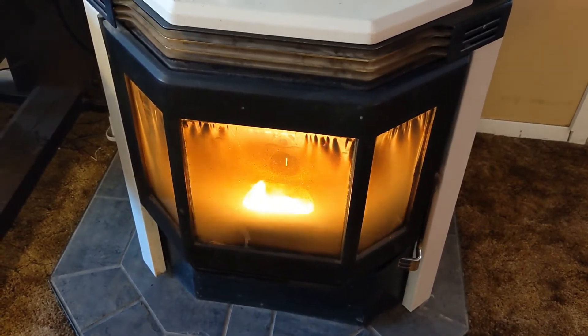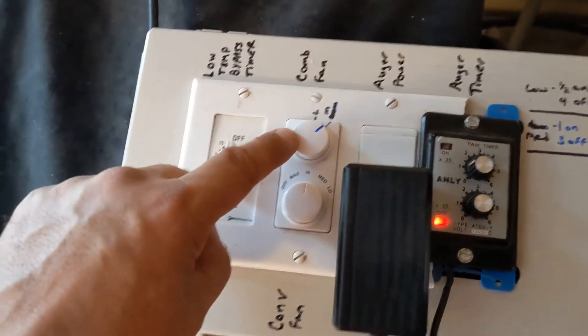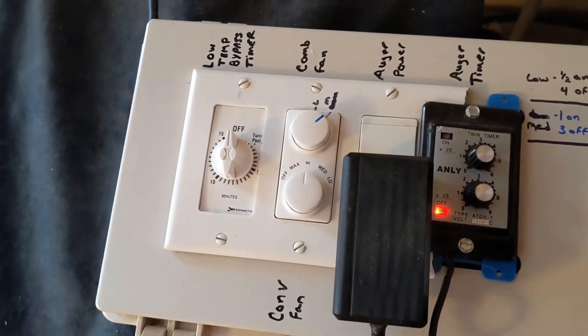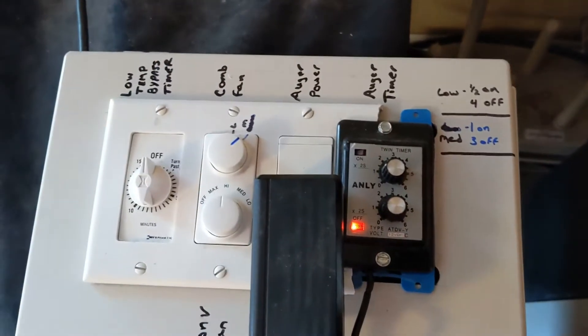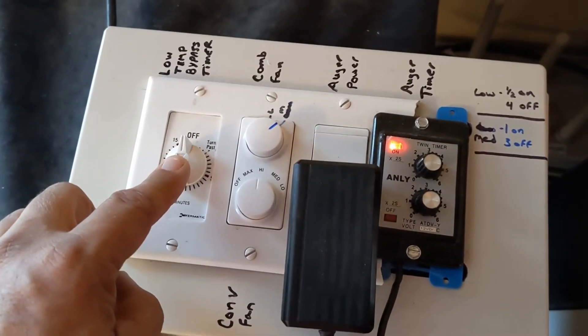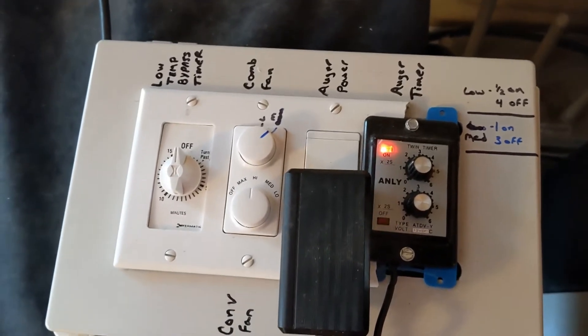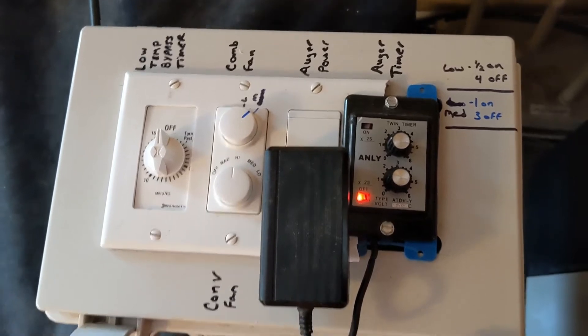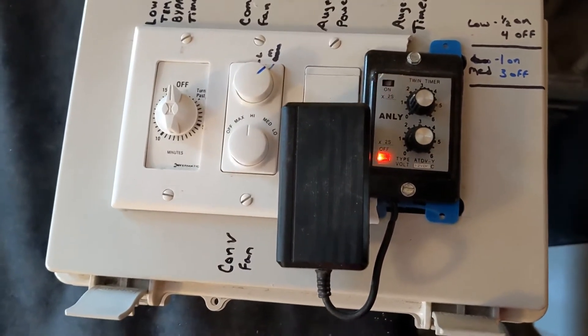There's a little bit more of my medium fire setting — it's definitely doing more than it was, you can see the flame flicker is pretty good. The changes I would make: use just dimmer switch jobs for the convection fan, use a 110-volt operated switch so you don't need a 12-volt source, and add a shutdown timer so when I flick the stove off it automatically quits feeding pellets and keeps everything else on until it's cooled down enough, then shuts everything off.